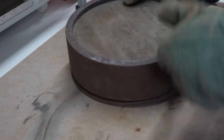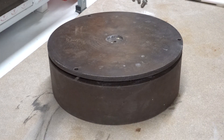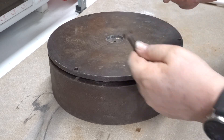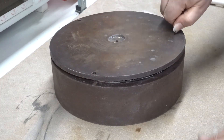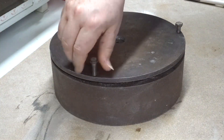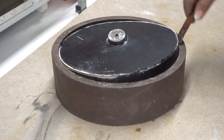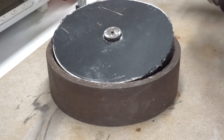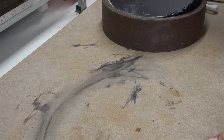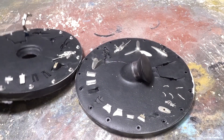Let's crack open the 9 inch mold and see what we've got. I have to work quickly as I need the mold to be hot for cutting, as cold rubber dulls the blade. First of all I remove the lid, screwing in bolts to pry it up as it's often hard to remove. Then I use metal spatulas to progressively lever the mold out. With the mold out I can split it open and take out the core plug and masters. Everything is still very hot, but the rubber has taken the impression of the masters well.